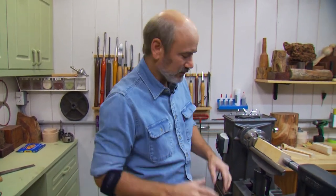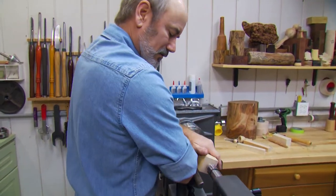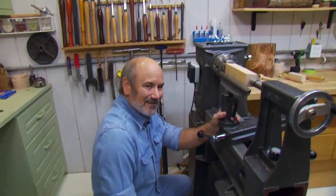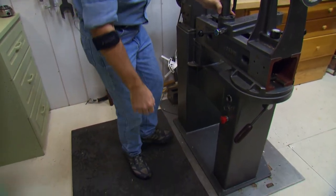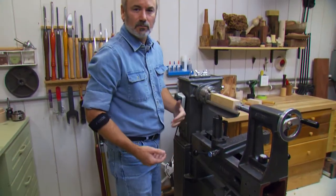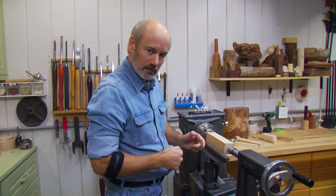The first thing to keep in consideration is a good lathe — it's about at your elbow height, with the spindle center right here. So with little ones, we're going to have to get them up a little bit higher. You want to build a platform. I'm on a mat right now which is just for softness, but you're going to have to bring them up six inches or more to get the child to the right height. Don't get them too high because it'll tend to get them to start scraping rather than cutting.